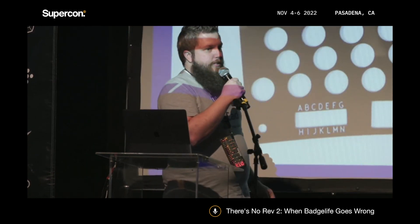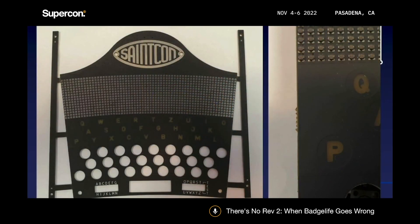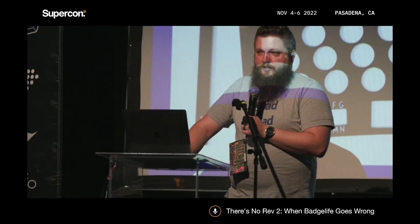Those boards were meant to connect to each other on the sides with little side connectors. The top panels had rails with mouse bites on the sides, so when you put two boards side by side there's a gap, and the connections were flaky. We didn't have time to fix it. Lesson: if you're making boards with mouse bites that need to fit together, push them into the board a little, or sand them off if you're not making too many.